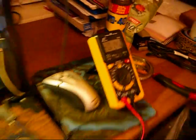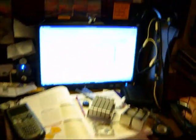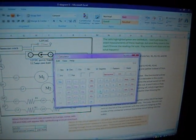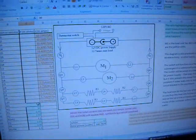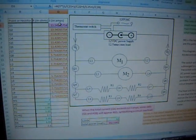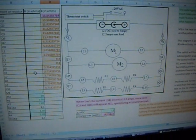So if I take a calculator: about 12.2 volts divided by about 1.8 amps, that gives me about six or seven ohms of resistance. That's really important because I can take this into the electrical diagram and put it right here. I was assuming that there would be 30 ohms for one motor — I'm going to put about seven in here and see what happens. It kind of overloads my circuit, but I have some extra resistors I can put in series with it to lower the amperage so it doesn't destroy my DC power supply. And that's it.